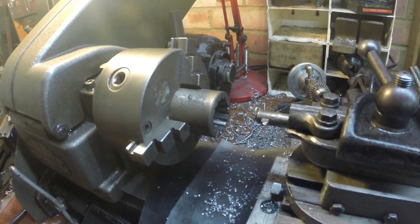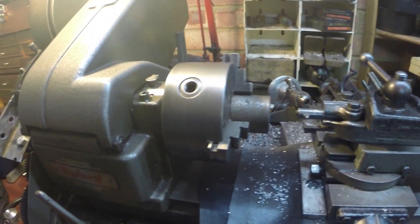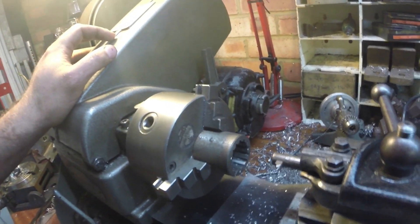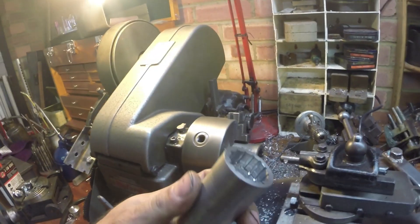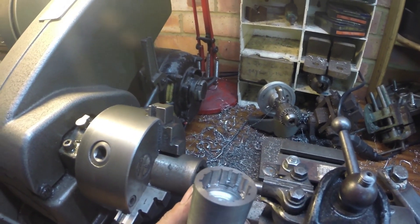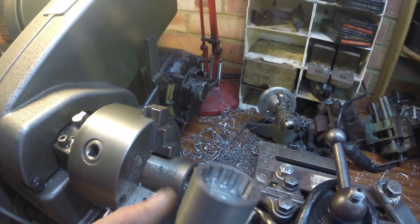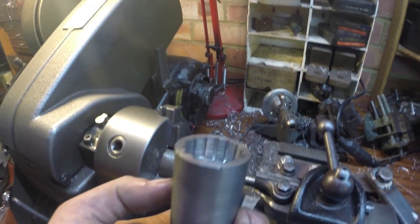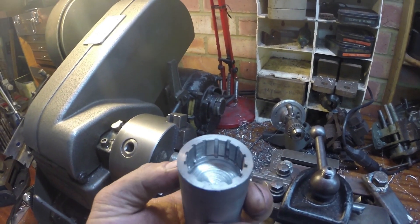It does work with steel — I did some steel cutting initially but I'm using ductile iron now as it's a little easier to cut. Tried some bronze — not so good. Here are my rough initial cuts; you can see something I learned: putting a little groove in at the end of the splines is really important. These are pretty rough because I was basically learning — I'd never operated a shaper, let alone turned a lathe into one. These were my try-it-out cuts.